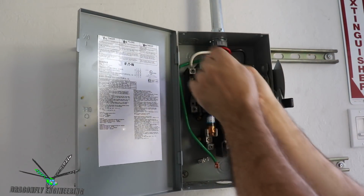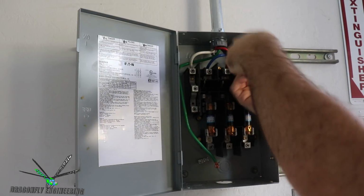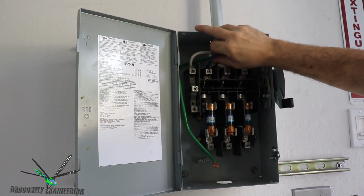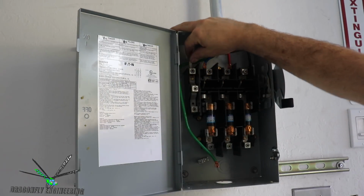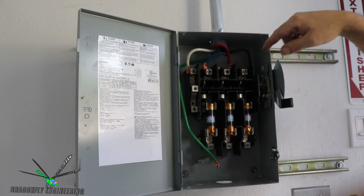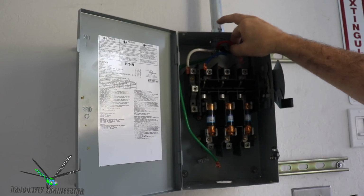I brought it just in case in the future I wanted to pull off 120 volts by basically different ways of wiring this three-phase power. It's also good to only have one hand in the box at one time. If you got two hands, then you may actually short your body and run power across your heart, which can stop your heart. So with all the other precautions, it's best just to have only one hand in here at a time.